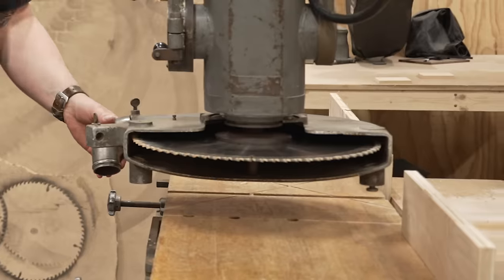If you're familiar with woodworking and you've heard of the term kickback. As soon as I heard Wade say the words kickback, I was like, that's a move. As I slide this through, my only option is to put my body directly behind this blade. Well, you saw what it was shooting off of it, and that didn't feel good. Kickback happens when you don't have your material against the fence and it pinches against the blade and then it pulls it and shoots it back.